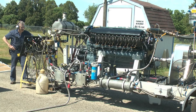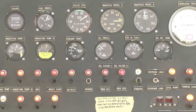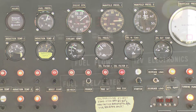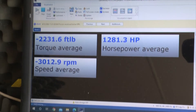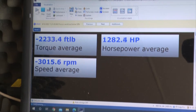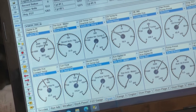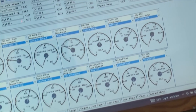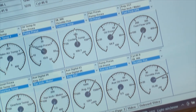The next power setting we'll be going up to is takeoff power: 52 inches manifold pressure or 3,000 RPMs. This is what the aircraft would be leaving the ground at. The equivalent of 11.5 pounds of boost. There's how much fuel we'd be using — 155 gallons per hour. There's the horsepower: 1,281 horsepower at takeoff. EGT gauges, cooling temperatures — we regulate this very carefully with all of our machines.